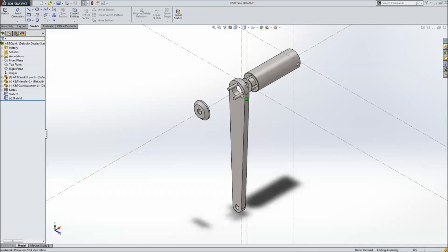And so I don't know that I'll do two. I might just do one. Then there's a large washer here and then a tapped hole in the center here. It's tapped a half by 20 to hold this whole assembly in place.